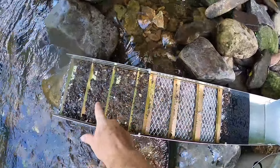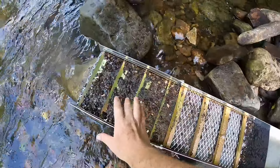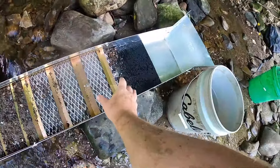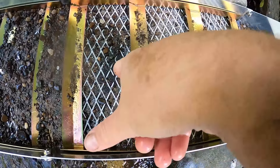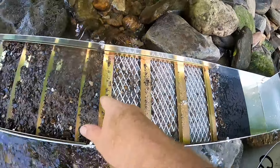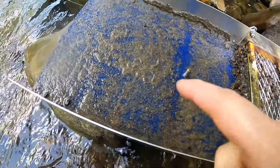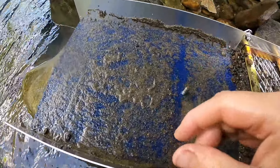I need to redo the sluice setup afterwards — it's lopsided and you can lose a lot doing that. I can see gold from here though. Most of the gold should be right at the header. The flow wasn't good enough and it wasn't tilted at a good enough angle, so there's more material at the end. All that black you see is black sand, which is almost as heavy as gold. I'm going to take it apart and wash the carpets in this bucket — even after all those layers, the fine carpet is still catching the small stuff.